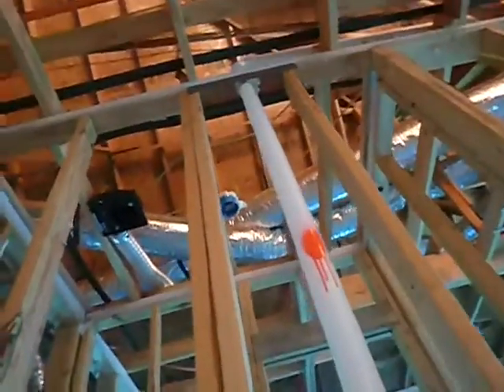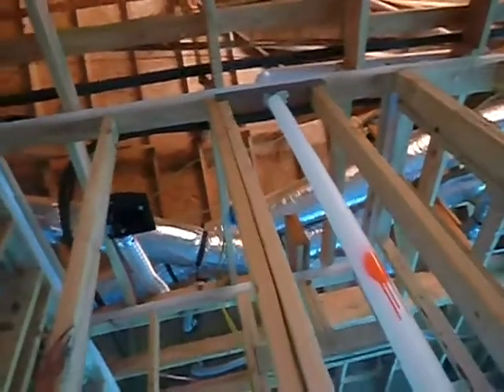We need to discuss the vent pipe in the primary bedroom slash hall wall and how it goes through the top plate — it might be over 50 percent and might need better support. Moving on along, this is a little linen closet, I suppose.